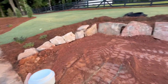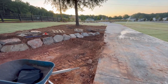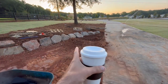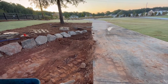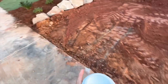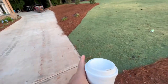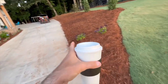And a lot of the rest of this stuff we'll just have to hand dig. This is such a tight little area. We're going to have to basically hand dig this. I could only get basically to right there. And then the width of the bucket was just too wide to get any further into that area. So we're going to do that. And then I've got to hand dig this trench here for the drainage pipe that's going to run through here. So we're going to dig a trench all the way down and put some pipe in